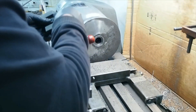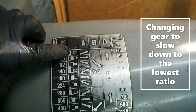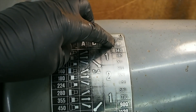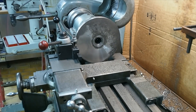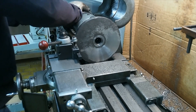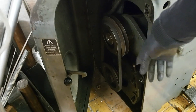It was at this point that I noticed I was running the lathe too fast. I thought I was running at the slowest possible speed but actually I wasn't. I've got two reductions — from the motor to the intermediate shaft, and then from the intermediate shaft up to the spindle. I need to be running at the maximum reduction on both the first and second reduction to give 71 RPM. Here I'm moving the secondary reduction down to the lowest speed. Some Bollies have a lever to make this more convenient, but on mine that lever mechanism for shifting the belt is not installed, so you have to reach in and do it manually — generally a pretty grubby job, hence the gloves. Then the next part is to move the input pulley from the motor to the intermediate drive down onto its lowest gear as well.